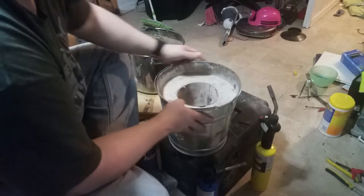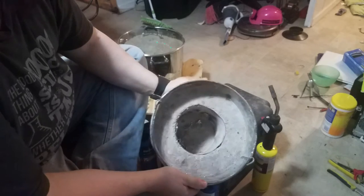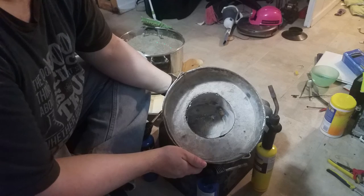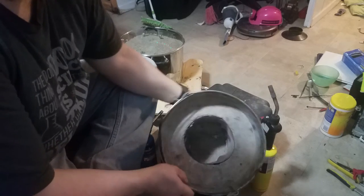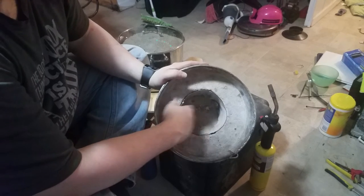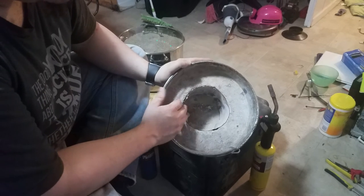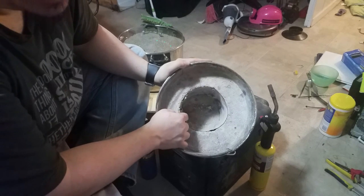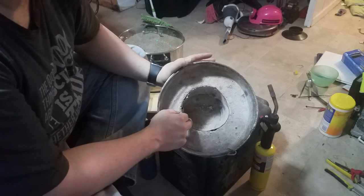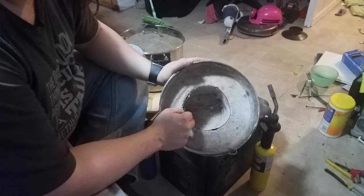This guy has done well for me. I know a lot of people have complained about using just pure concrete — it doesn't work so well because it cracks and falls apart and degrades. I have found with using the chimney pipe in here that, you know, this is just tin, but it's lasted through thousands of degrees. I say that because I have melted aluminum in here, I've melted glass in here, I've melted copper. Some of these have to get up to 1,400, 1,800, 2,000 degrees Fahrenheit to melt. And as you can see, I still have metal in here.